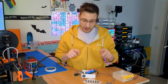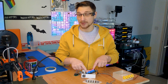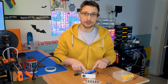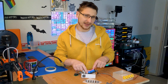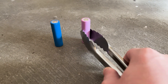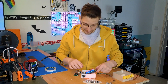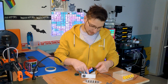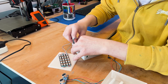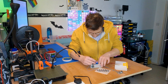One note: do make sure that you've pre-charged your 18650s and make sure they are balanced. I plugged in two unbalanced cells and one of them went up to like 5-point-something volts and it got spicy — I had to put it in the timeout corner. But it seems okay now. I've balanced these before putting them in here. It does also let you charge it, but I'm not going to have the charging ports accessible from the outside. I tried my best at spacing everything out here, but it's still going to be a little bit tight.